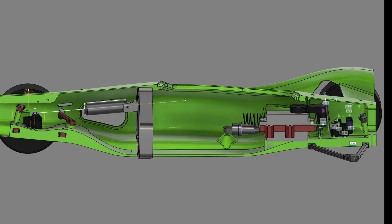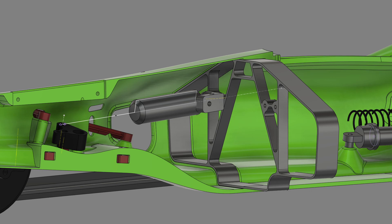The next unique feature is the canopy opening. There's no requirement that this actually look like an actual car, but I needed to access and install all of the internals and electronics, so I decided to make it look cool. Cutting a hole in the monocoque is actually bad since it's our structure, so I have to add a thicker profile all the way around that opening to reinforce the shell so it doesn't separate or collapse. I then printed some test pieces and realized this wasn't going to be strong enough. The monocoque is about 450 millimeters long, larger than my 3D printer can print in a single go, so I needed to split it in half — just behind the canopy opening — and added a plug or joiner to strengthen the glue joint between the two halves.